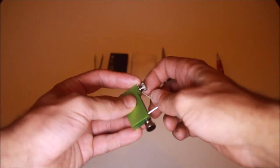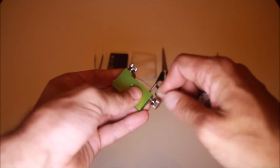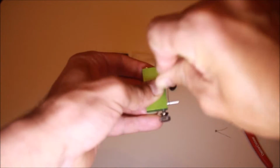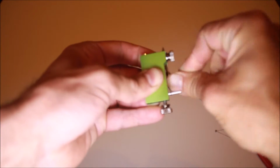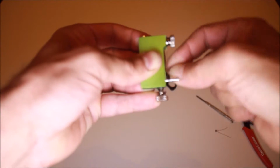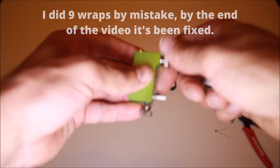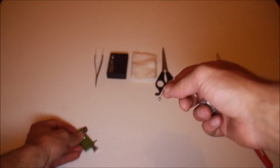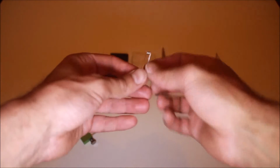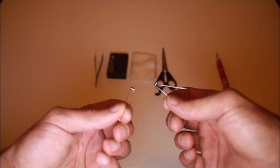With the coil jig, or helper, or whatever you want to call it, you put the wire under this top screw, or probably you have a different model, but it works basically the same way. Pull the wire close, always keeping a lot of tension. Don't be afraid of breaking it, because it won't, unless you're using a really thin gauge. 6, 7, 8. There you go. You can take this back side out like that. I just cut the excess. There you go. You'll have a perfectly wrapped coil, whatever method you prefer. No gaps.